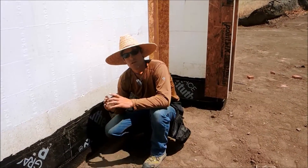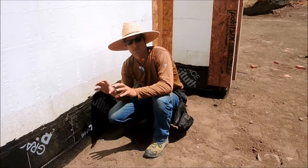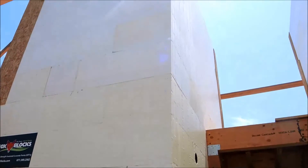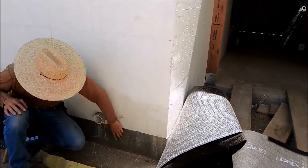At the bottom of that, we also have a double perforated four-inch drain line — we actually ran two of those parallel. It's a nine and a half to ten foot tall basement wall. This is our slab, with the ICF resting directly on the slab.